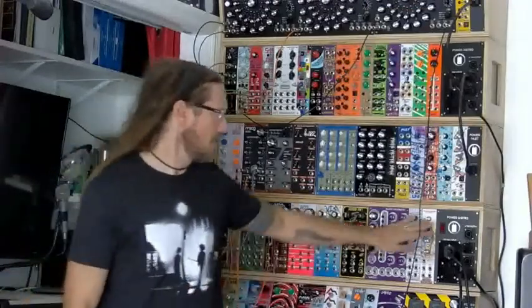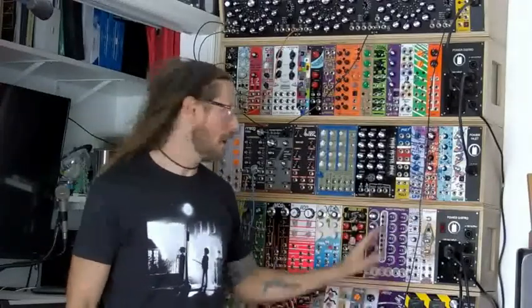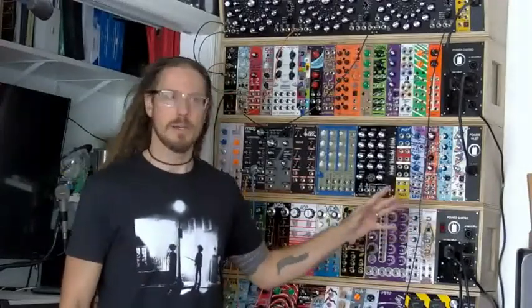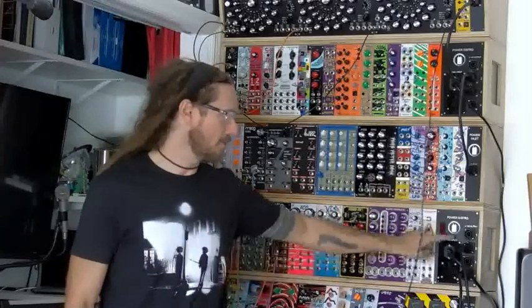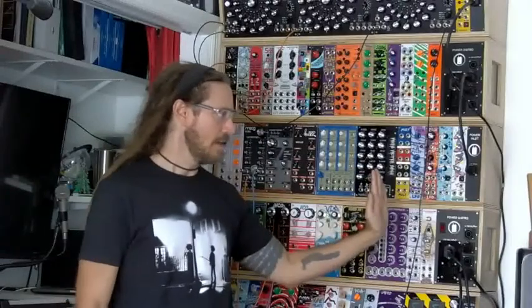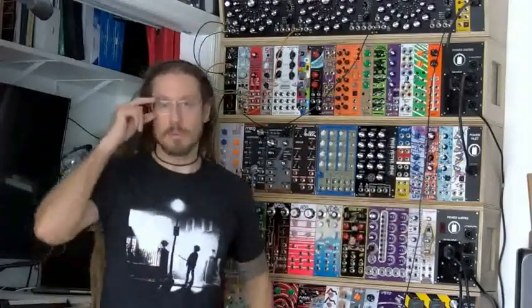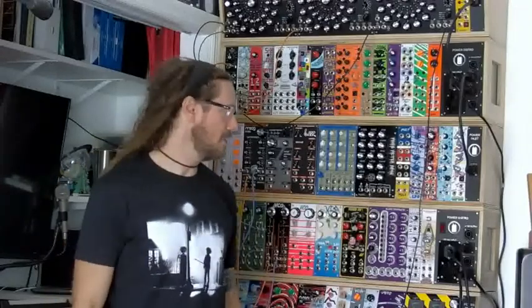And then you've got your panel. Let's talk for just a quick second about how I built mine, because this is not the only way to do it. You'll find designs for this very supply board that have it oriented vertically, and mine is oriented horizontally. The main reason for that was heat dissipation, because this thing does generate a lot of heat.